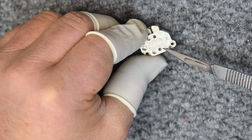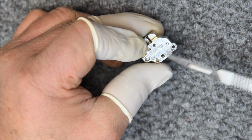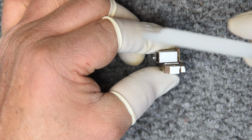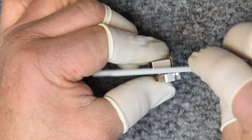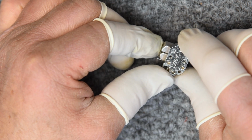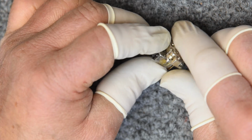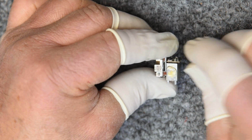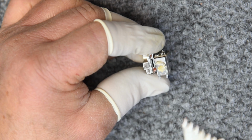These two small grub screws here are responsible for setting the record head tilt and ultimately the height. And they should be factory set. However, I've seen them actually out, and I don't know if it was a factory defect or if they worked their way loose. But they are inboard and not serviceable without removing the head, of course.